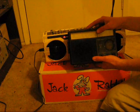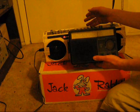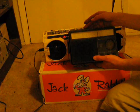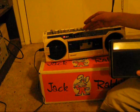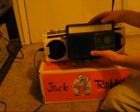How does all this work? Well, every broadcast receiver has a little oscillator, and that signal from the oscillator beats with the incoming signal, and that allows SSB and morse signals to be received. If you're tuned into an AM station, you don't need that second oscillator, but for most amateur activity, you do.